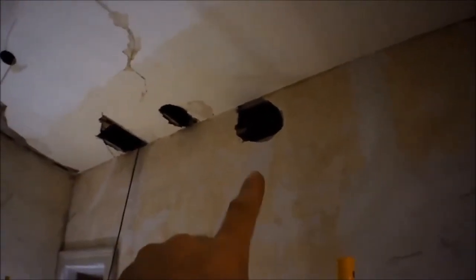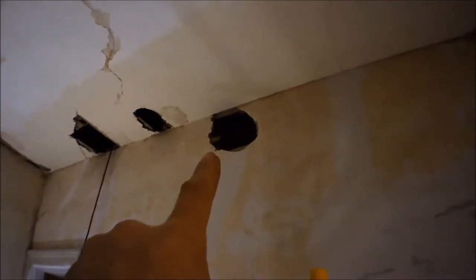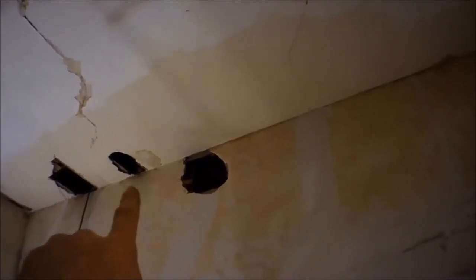I got the first one in. It was pretty easy — just shove that thing in there. Those clips open up and they grip really tight. That thing's up there nice and snug, and that's what you want — you want that thing airtight. It looks really good. I haven't taken the wallpaper off yet, but I wanted to see what it looked like. I've got to patch up all these little cracks in the plaster, take all that wallpaper off, fill all this stuff in. The other day I also fixed the wire that goes up to the breaker box upstairs — they had run that thick cable outside of the wall. I had to turn off all the power, take the cable out from the fuse box upstairs, pull it back out, and run it back in through the wall so it wouldn't be showing. Now I can patch up those holes.